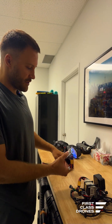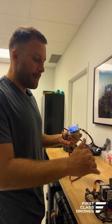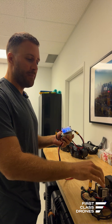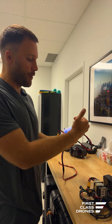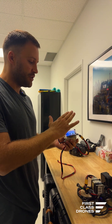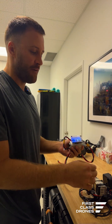How this works: there's a voltage regulator on the pocket battery that keeps it at a level lower than both the dead battery and the charged battery. When you plug it in, in combination with those, they try to equalize into this battery — they try to push all their power into it — but there's a diode to stop that from happening. That allows you to plug this in safely with a dead battery and with a fully charged battery.